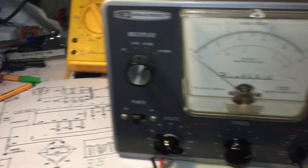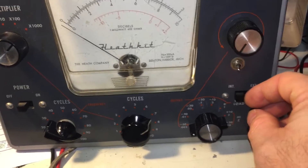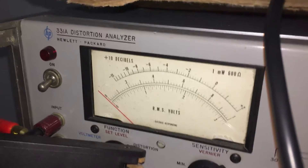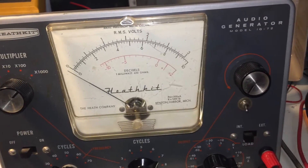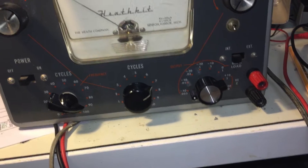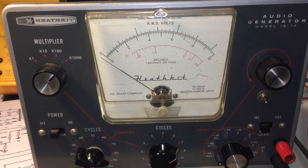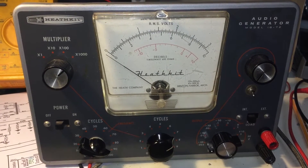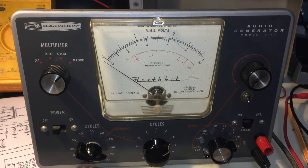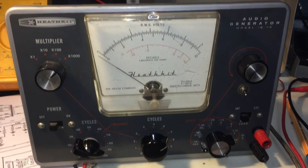This would be a cool candidate for restoration. The fact that it has a 600-ohm matching impedance load would be nice — the 331 Alpha also expects 600-ohm impedance, and the Dynaco stuff expects 600-ohm impedance input as well. The Fieldtech may actually outperform this with regard to sine wave since it's much newer, but this is Heathkit, so we're going to roll with this. Stay tuned as we restore the IG-72 audio generator from Heathkit. Thanks for watching.